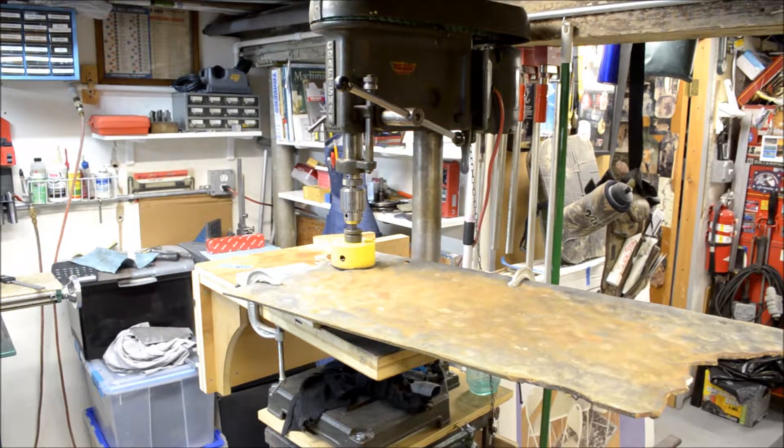I have it set up in the drill press. I already went ahead and drilled a pilot hole for the pilot bit for the hole saw and got it clamped down in the drill press as best I can. I know it looks a little bit hairy. We'll be running the drill press at its slowest speed. Ideally with the three and three-eighths hole saw and cast iron, it equates somewhere around 75 to 90 RPMs. But the plate's not that thick — it's only barely a quarter inch — so I think if I feed it slow we'll be all right.